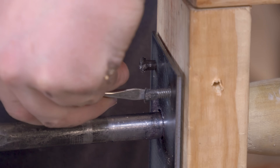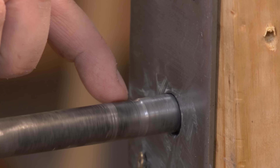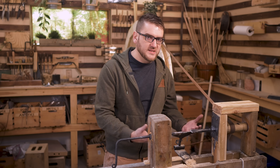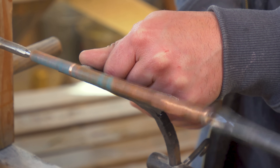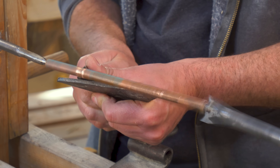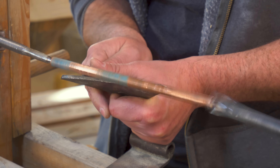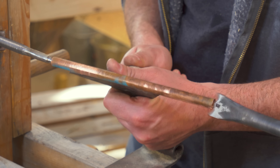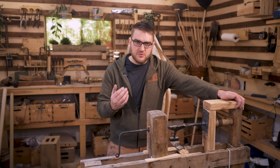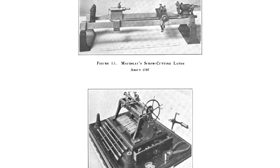We started reinforcing, but I think we made the bearings too small — they're putting friction all in one spot and actually cutting through the spindle. The next step is to make the bearings a little wider to spread out the friction and provide more area for grease. We took a stab at cutting metal on it and it seemed very promising. The main issue is it's hard to hold a metal cutting tool steady with it bouncing off. That reveals the next major historical step: building a lockdown carriage that utilizes screws to finely adjust and hold the tool itself — so it's not the machinist doing the cutting, but the machine. We're going to start adding onto this and making improvements, entering the era of Maudslay and the invention of precision.